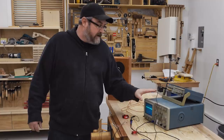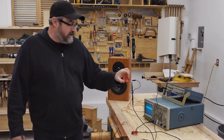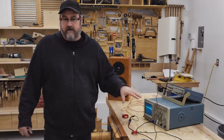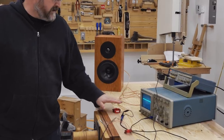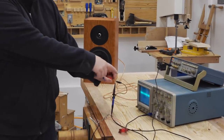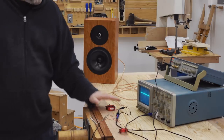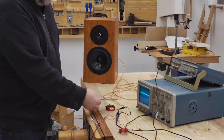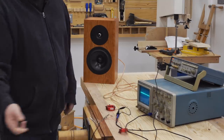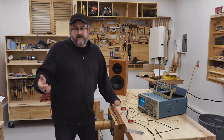What I have here is my oscilloscope on the bottom, connected to this coil right here. You can't see it on the screen but I'll get it in closer. You'll see that even me touching the coil will cause interference to show up on the scope — touching it, putting my hand on it, or putting a metal plate near it will cause it to do things. But that would be noise, not the mutual inductance that we're talking about here.